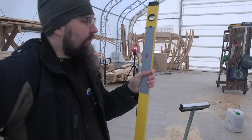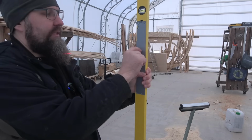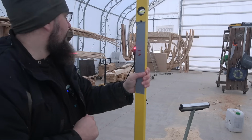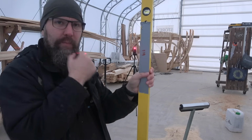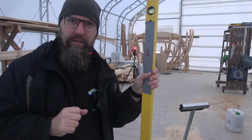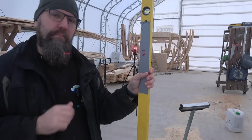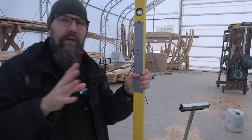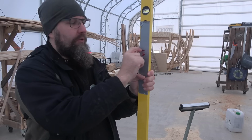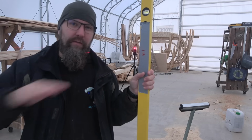But what this means, if I'm going to do it the way I explained last time, is that I need at least 3 centimeters thick wood to reach from the lowest to the highest level, so that there's still wood left in every position. But that's a bit annoying because the standard board in Europe or in Finland is actually 22 millimeters. That is a basic board you can buy cheaply from the shops. Now what I'm doing next to test this out is to grab a piece of wood, maybe 3 centimeters thick, drill it to the floor and try to plane it smooth.